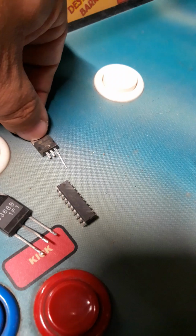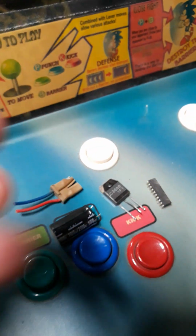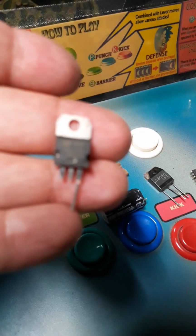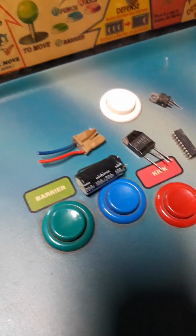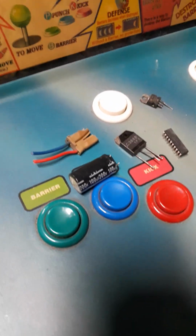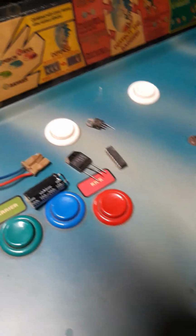7500. Monitor as well, or soundboard? Yes, monitor. Okay. That is for the horizontal side. You can see two of the pins broke off. It's got a plug and it's extended out back on a heatsink. Just wiggled loose. I just changed the whole transistor. I don't really try to fix those. So when we go through these games, just by having them on, other problems can surface.